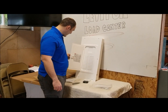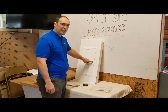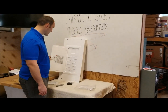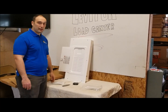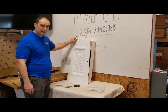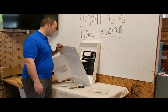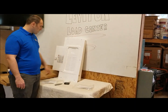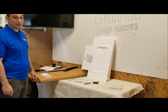Even that little clip is nicer than usual — it's not just a bent piece of plastic, the mechanism is just a little better. There's a knockout for your main, so if it's a main-lug panel you just don't knock that out. It's got good heft and a decent gauge of steel. There are adjustment screws so you can pull the middle section in tight to the breakers if your drywall isn't perfectly flush. I think Leviton load centers are going to shake up the industry quite a bit — there you go.